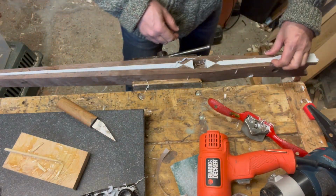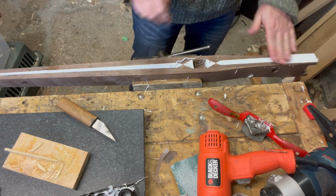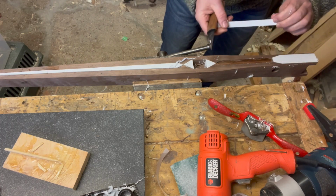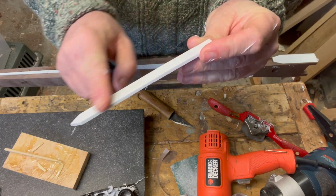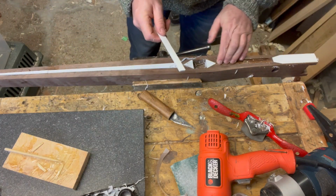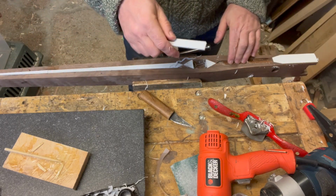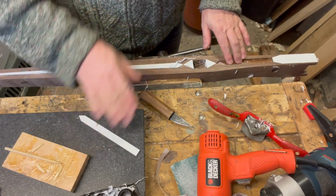Sometimes that happens. That is a pain. Well, in the interest of transparency, this has come unstuck. You'll notice there's no epoxy on this at all. That's because I didn't score it. So that's a lesson right there: make sure to put some little knife score marks in there, because that'll get the epoxy to adhere to the plastic a bit better. That's a pain.